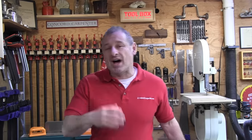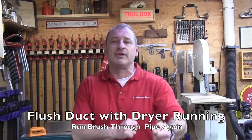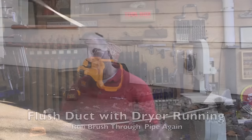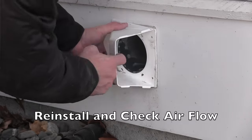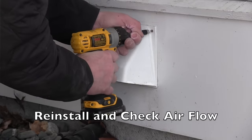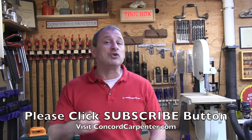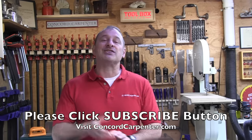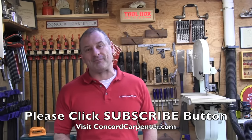When done cleaning the whole pipe, turn the dryer on and let it exhaust, then run the brushes through one or two more times while it's running — and wear a dust mask. This will help clear anything loose in the pipe. After cleaning the ductwork, reinstall the dryer and put the dryer hood back on. Following these steps puts you on your way to a much safer and faster drying experience.